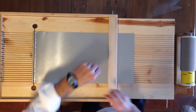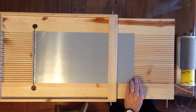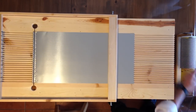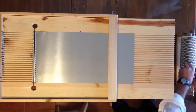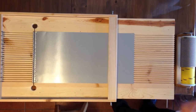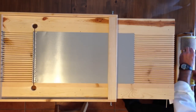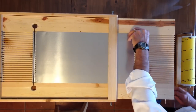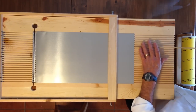I now demonstrate the operation of the device by cleaning 2,500 magnets in 35 minutes, which amounts to 0.85 seconds per magnet. I alternate the polarities of successive magnet chains as I place them in their channels, so their magnetic fields largely cancel. This produces a more stable magnetic configuration. I use a 3/16 inch wooden dowel to push the magnet chains up to the slot.